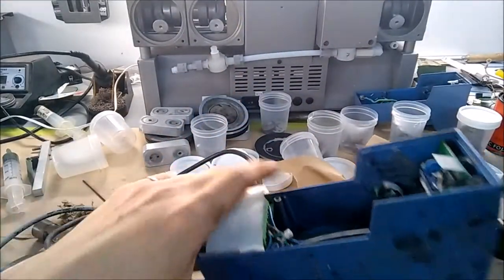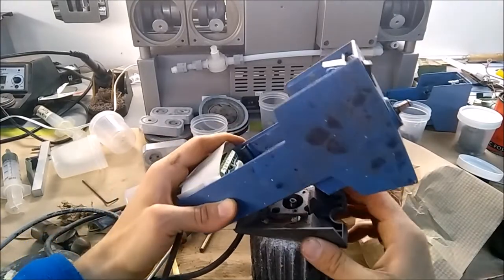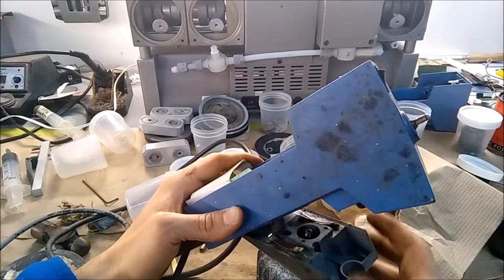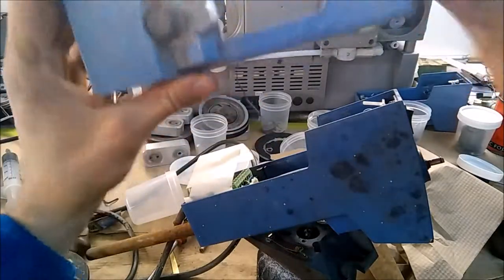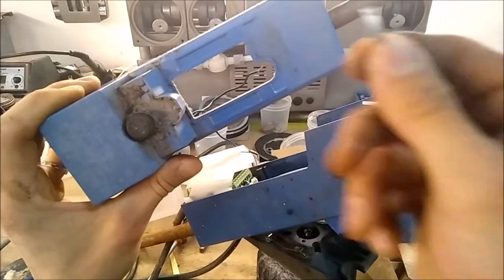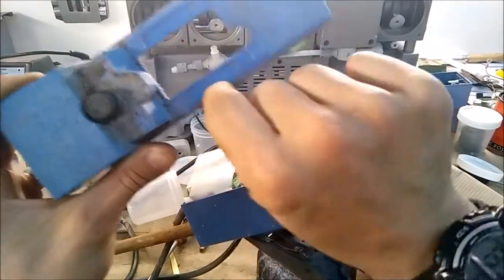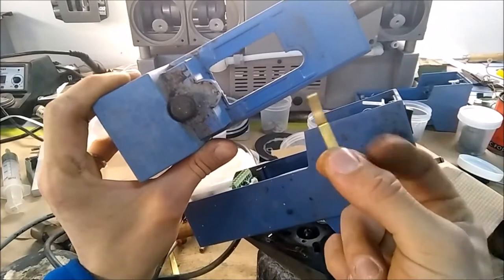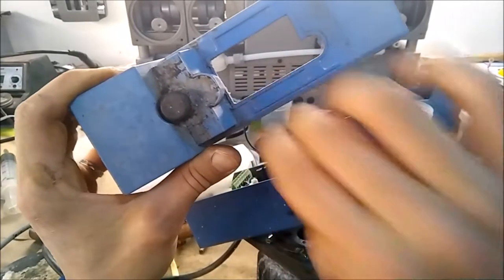The motor lifts because there are two little springs. On this one, very surprisingly, they've survived. The motor rides back and forth in a little track with the springs sitting in it. I've been finding the springs get horrifically corroded and come out in multiple pieces or literally dust. You can order more springs, or my solution has been to cut a 1-thou brass shim and bend it so it fits inside the slot — it's doing a serviceable job for the low price of free.